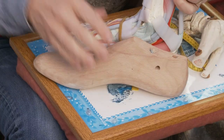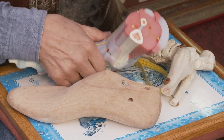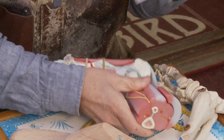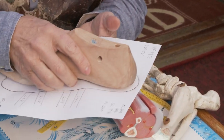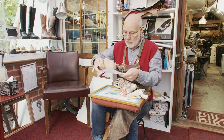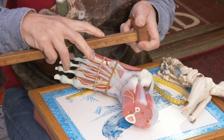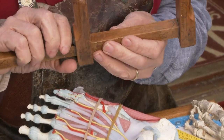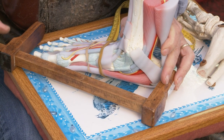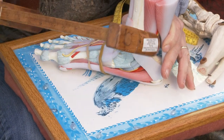Now we have the complete draft. Here's the last that this foot would fit into — if the last were flexible you could put this foot into it, and the draft is made to that foot. All we need now are two length measures, which are recorded on here and done with a size stick that slides up and down. This particular one has inches, millimeters, French Paris points, and English sizes. With the client standing in stocking feet we place the size stick beside and just touch when the foot is standing, recording the measure in millimeters.